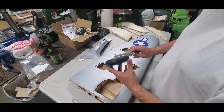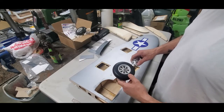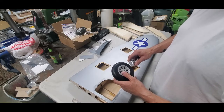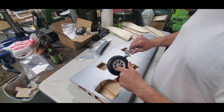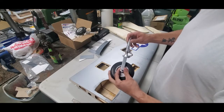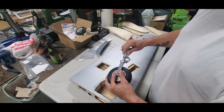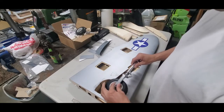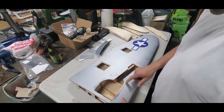The wheels I have are 4.5 inch — bigger than the 3.5, though I probably should have gone with 5 inch. A few months ago rubber was at a shortage and I was almost giving up and turning some out of wood. But Tomas down at Legend Warbirds, also in Texas, had a set along with Sierra rims. He shot them off to me at a good deal. These Sierra scale struts were milled down to accept my retract, and the length was also worked on to fit the previous project, but they're going to work out just fine.